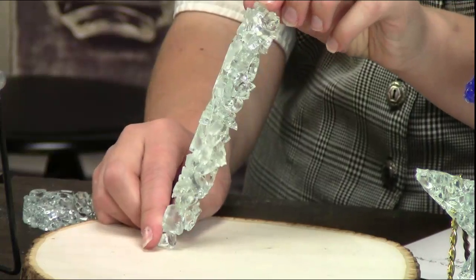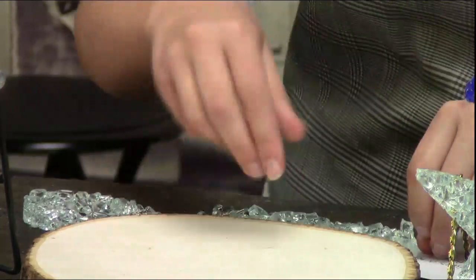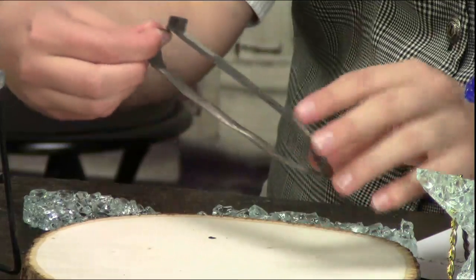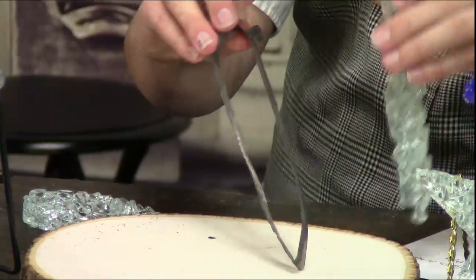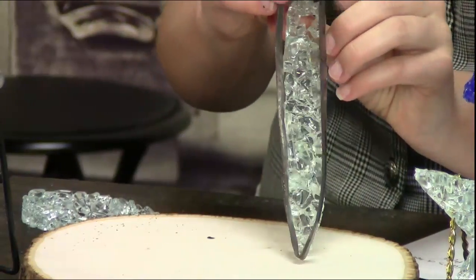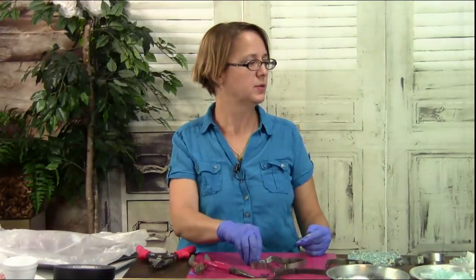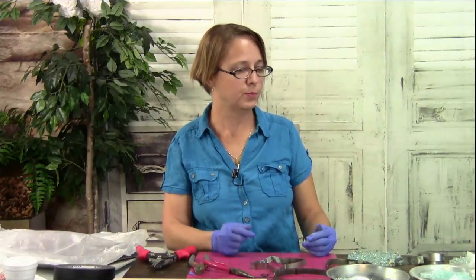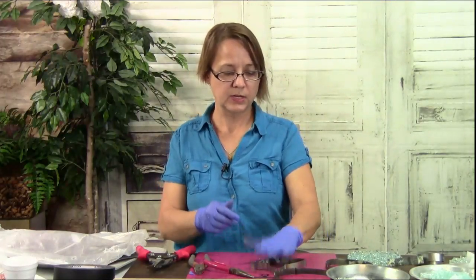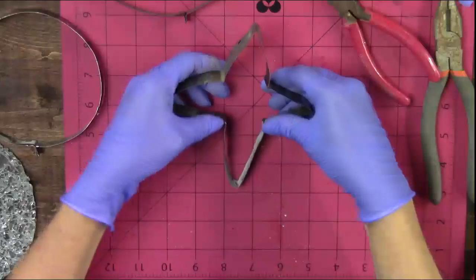Do you see the mold we made the icicle with right there? Looks like a big spike. Yep, this one. So what you do with that is you line it with paper, and then you put a piece of chalk in it to keep that hole. And then you fill around it with broken tempered glass. Okay, so here's another one we just made, like boom, just like that.